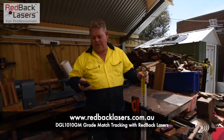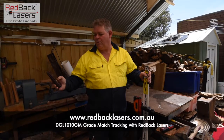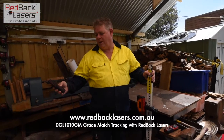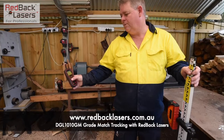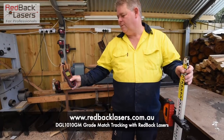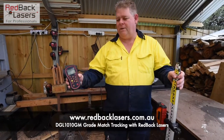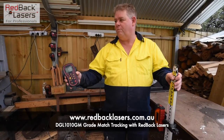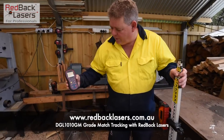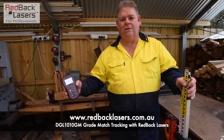And now it's coming back down to track to that receiver. If we turn on our remote control, make sure our channel matches — so I've got to be on channel 2. I've clicked that through to channel 2. On my remote control, it's showing me exactly what's happening on the control panel of my laser. So at the moment, it's still tracking for an X grade, and we'll wait for that laser to track down to the receiver.